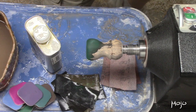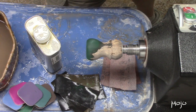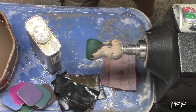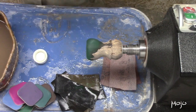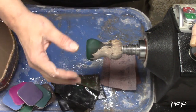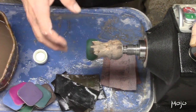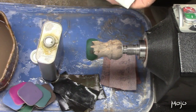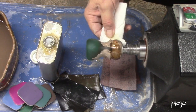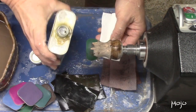Let's see. Looks like a caramel apple. Yeah. Okay, what I'm doing right now, I just prepped it. And this product that I'm putting on it right now is called Sanding Sealer. It's really more for the wood. It's one of those chemicals that gets down inside the wood and it microfills all the little crevices inside of it so that it makes it so much easier of a sanding. That crevice right there is going to be a turd, so let's get that out that way.